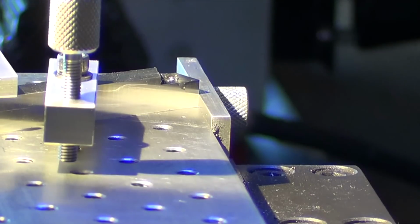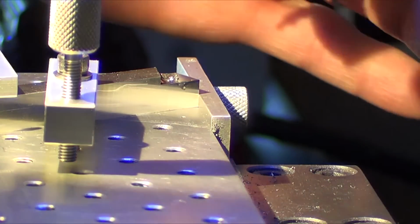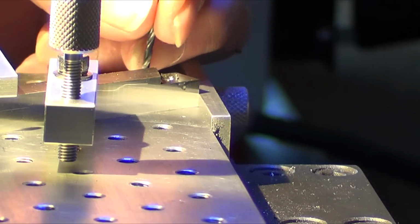Put the drill bit in there now. Where's the chuck key? Okay, chuck drill bit. There we are. And this was, according to the print, a 2.5 by 0.45 thread. 46, number 46 drill bit. Goes up in there. I can get it up in there. There we go. This guy too. I'm putting it as far up in the chuck as I can.